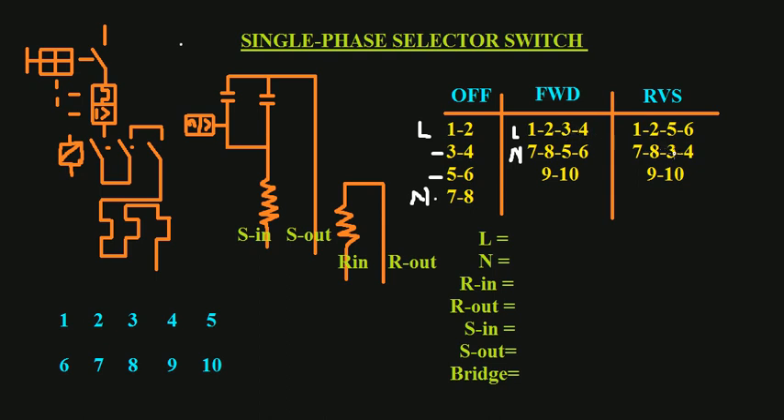On the reverse side, three and four connect to the neutral. Remember that to change the direction of a motor, we have to swap two wires — the live and the neutral. So the run-in and run-out connect here such that one side becomes neutral and the other side becomes live. That swapping is how direction reversal is achieved, making these our run-in and run-out terminals.